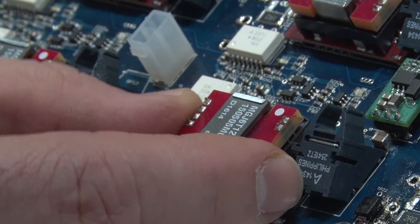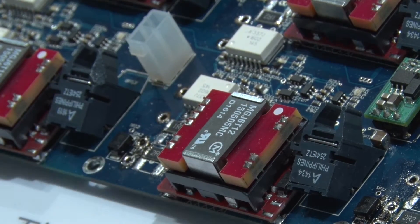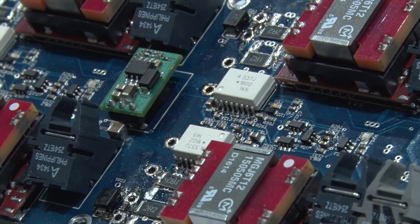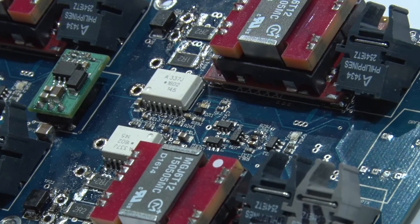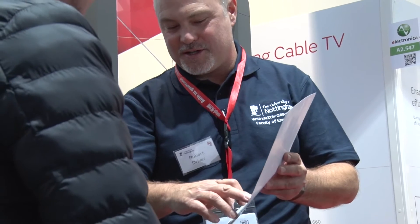In terms of the actual product we're using, the part is an MGJ6 — a six watt DC to DC converter. It's been specifically designed for driving IGBTs and MOSFETs. The MGJ DC to DC converter is a high isolation device, used to power the high side and low side drive of IGBTs and bridge technology for IGBT and MOSFET applications.